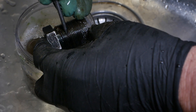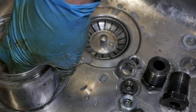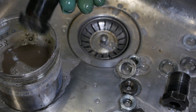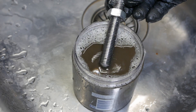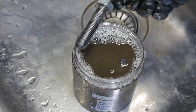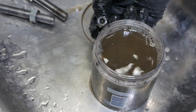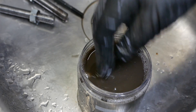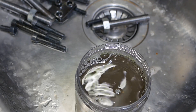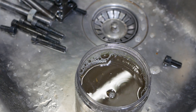The second one still had a bit more gunge stuck in the threads, so I put it back in along with the other parts. I must say, it certainly does what it advertises — all these parts are looking great. These screws all had a lot of gunge stuck in their heads and none of that's left. Five minutes in the barbecue cleaner at 50 degrees Celsius and everything comes out clean as a whistle.